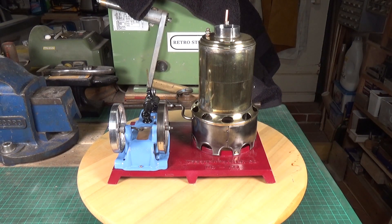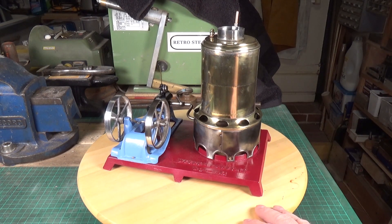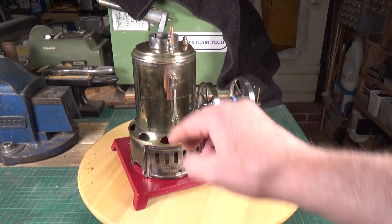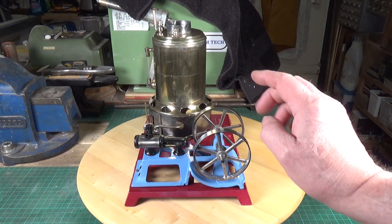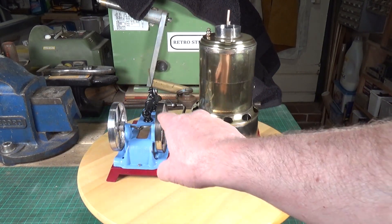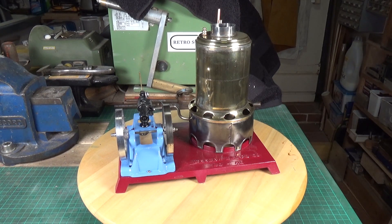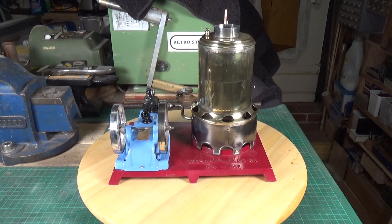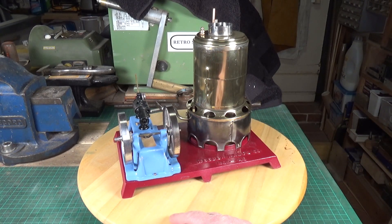The restoration of the Weedon 49 is proceeding quite nicely. The base and engine frame have been stripped of paint, de-rusted, etch primed and repainted, and they've come out quite nicely. The boiler's been cleaned up — wire brush on the steel part of the base and hard graft polishing on the boiler. We now have another flywheel. It is very slightly smaller than the original because I had to use the original as a pattern and you get some shrinkage when you cast it, but it's a lot better than just having one flywheel. The next job will be to machine up the eccentric.